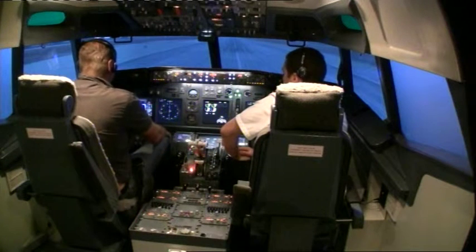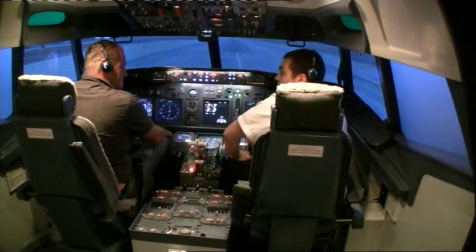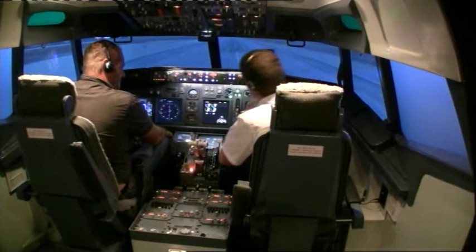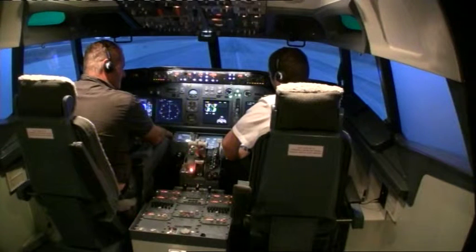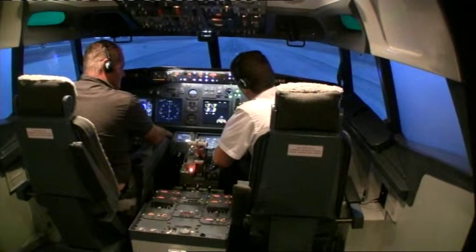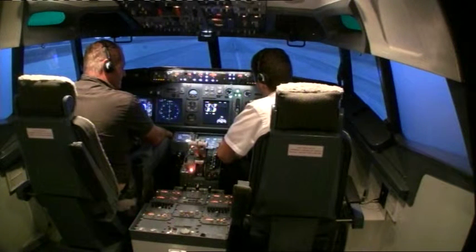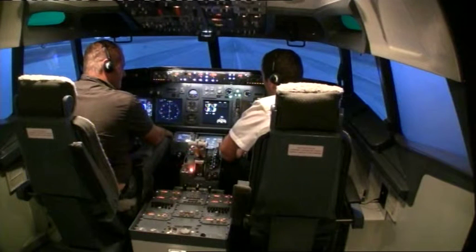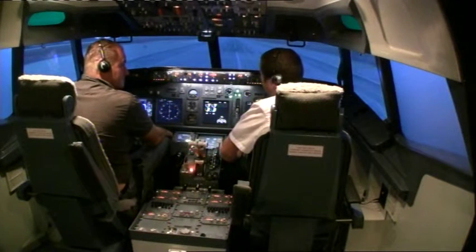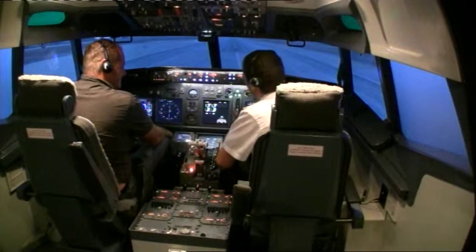Now some systems. Just three of them, just briefly. Number one, the wheels or the landing gear of the aircraft. They come up and down, in and out of the plane. We operate that with this lever just here. And just to make sure we don't go pulling the wrong lever, there's a wheel on the end to remind us what it's for, and the lever's shaped like a gear strut. Now you've got two positions, down and up. It's pretty self-explanatory. But when you do move the lever, you first pull it out, because it's locked there for safety. Otherwise it's not going to move.